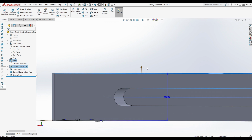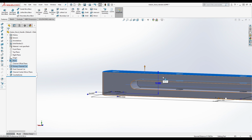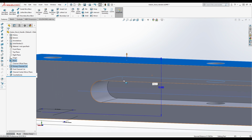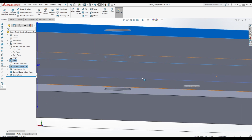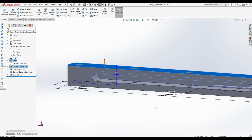So it really pays to figure out how they did the model so that you can do it that way. Because if you do it the way they did the model, you're getting rid of a lot of tolerance stack issues. I don't know if this makes sense. Just take my word for it. It's a lot better to have their original CAD model than to have a perfect 3D scan of a particular instance of their knife, right?